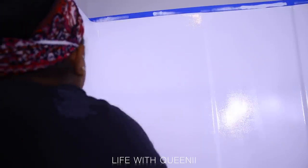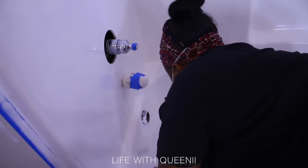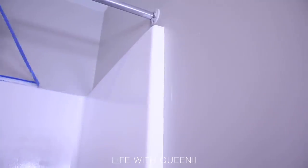For the first coat I used about five to seven foam rollers. You can use small ones to get into tight spaces around the tub spout, drain, and handle, but I suggest getting a wider roller — I ended up going to Home Depot for wider rollers, which were much better. I got the second and third coats done in half the time the first coat took. Going back with the box cutter to score the tape so you can take it off as clean as possible. This is how the tub looks — from the old ivory bisque color to nice bright white.